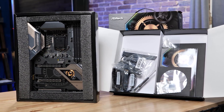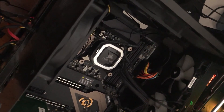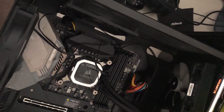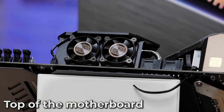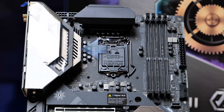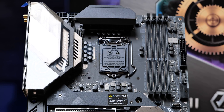Not content to just do a motherboard review — we've actually got to do a test and a build and put it through its paces, do some overclocking and really insane things. First thing you notice about this motherboard taking it out of the box is two VRM fans, dual 8-pin connections for CPU power. And when you look closer, you see a third VRM fan. This motherboard does not mess around when it comes to VRM.